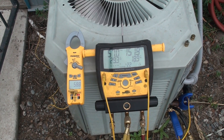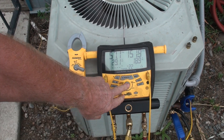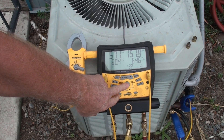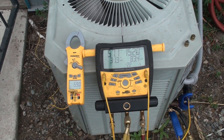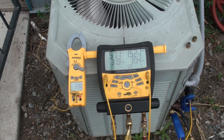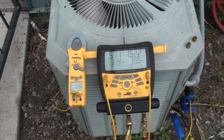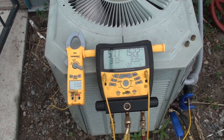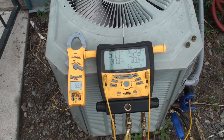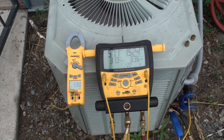I'm going to try something else before we do that. Notice our head pressure and our condensing temperature. This machine probably runs about 30 degrees above ambient for its normal condensing temperature — it's an older machine — and we're a bit under that 30 degrees now.